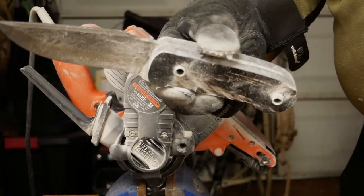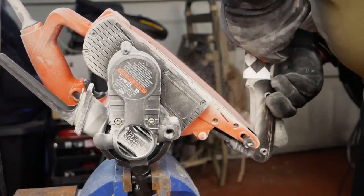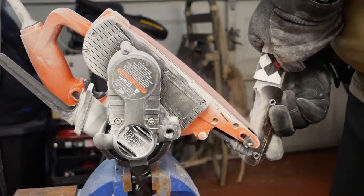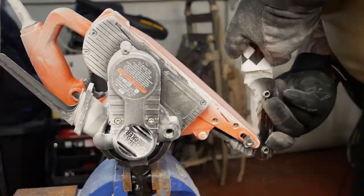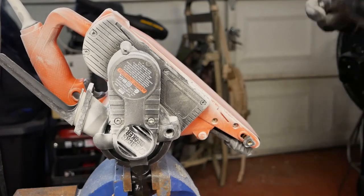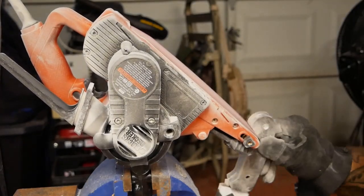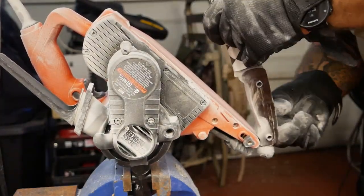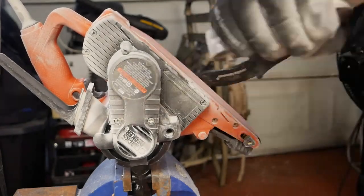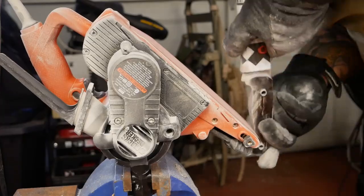I also had a slight issue that the billet was actually a little bit wider than the scale, which meant that right at the back of the handle there was a little knob of the billet sticking out and not covered by the scale. So what I ended up doing there is just grinding away that piece of the billet until it was the same width as the scale, and it actually worked out really well because now you can't even tell that there was ever a difference.